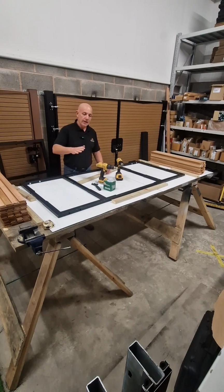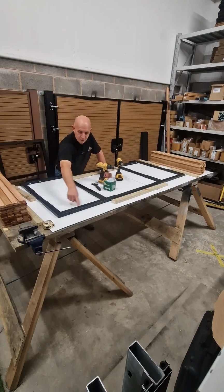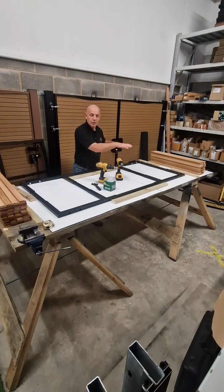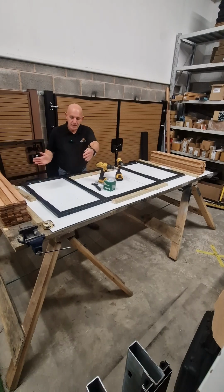It's designed so you can adjust it and just panel one face, but today we're going to be paneling both faces of the gate. In terms of adjustability, when you slide it together, the frame itself is made up of an F section here, and there are 4 F sections in total, 1 in each corner. When they all join together with the center rails, that's what creates the telescopic effect.